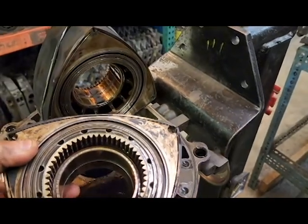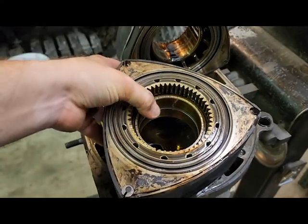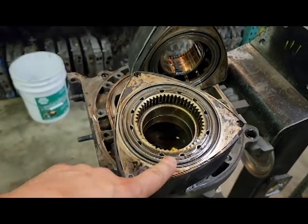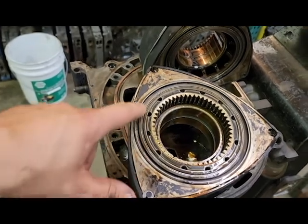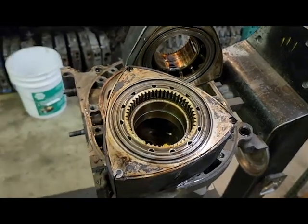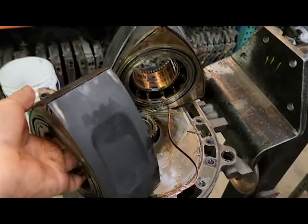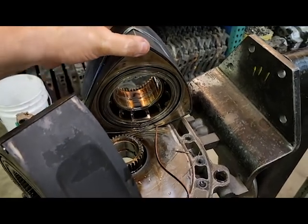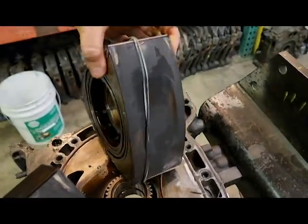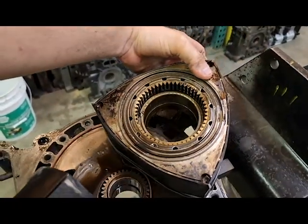However, you do have some usable pieces. In this case you've got the oil rings — the springs underneath them can be reused, or you can change them if you like. On the RX-8 you have your carbon scraper ring or cut-off seal, and that can also be reused. Keep your seals in pieces — you might be able to put them back together when you reassemble.